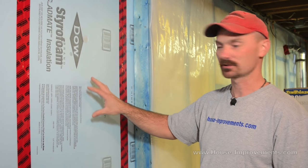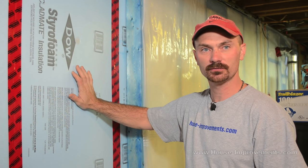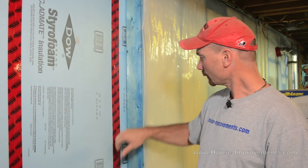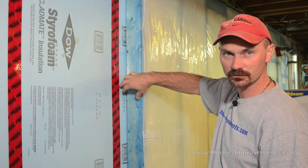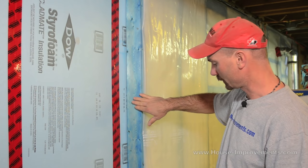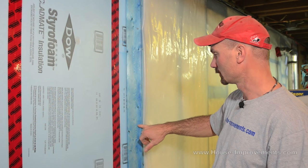In this case we're insulating a basement wall or re-insulating it. In this system we're attaching styrofoam right on the wall so it's giving an insulation value as well as acting as your moisture barrier. As you can see behind me here we've then got our stud work which is 2x4s framed with the blue wood — a new product that's been out for a couple years now. It's moisture and mold resistant and it also has a little bit of a fire retardant as well.